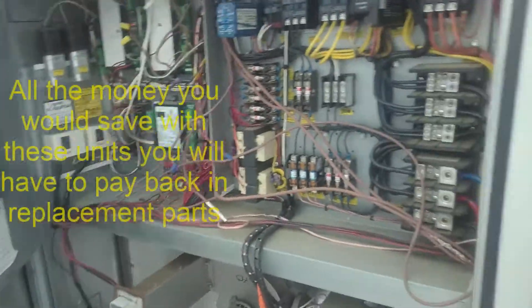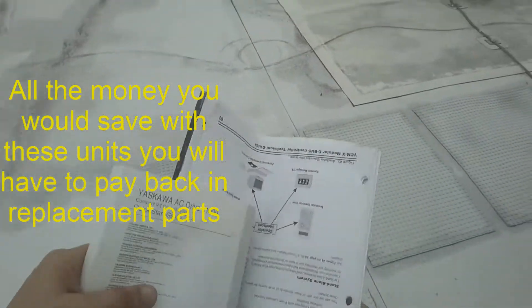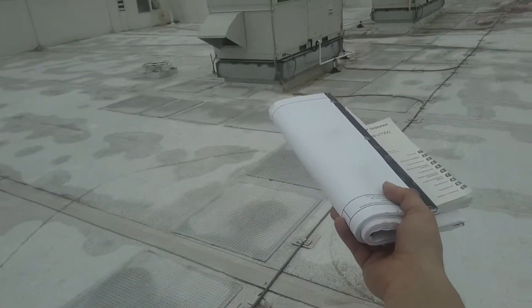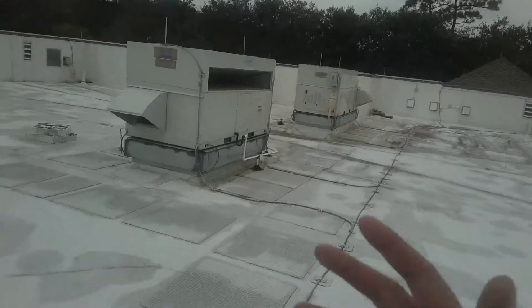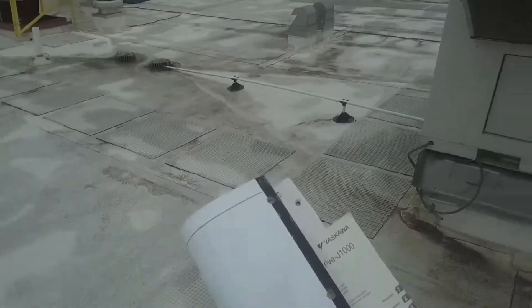Always need to be babysit. But as you see I'm gonna take these home — I'm gonna read them like I said in the last video. Get an idea of what's going on maybe. That one — it might have been blinking dirty filters, but it wasn't blinking dirty filters, it's blinking control temperature thing. And when I took out the filters I rebooted the unit, and also that wire was loose, which is the main cause of it. But I did not reboot the system after I put the wire back on. Whether or not they have a self reboot — probably not — because I came up a day later and made that video, and it was still doing crazy crap. But now the drain pans are gone — that means it worked over this weekend.